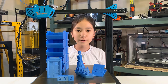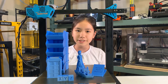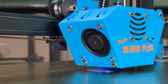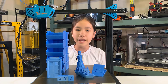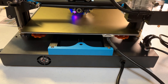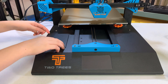The hardware configuration is really good. The manufacturing cost of the printer is higher than other printers in the same price range. The combination of the dual-gear extruder, dual cooling fans, and the Volcano-style heater block work really nicely in terms of print quality — it's comparable to the Prusa and Ender 5. There are also small detailed improvements like clean cable management, the heated bed cable strain relief, the metal sheet base, aluminum parts, and convenient access to the motherboard.